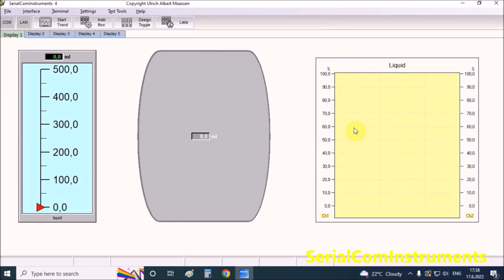Let me also mention that to each individual instrument we can add a value from a different sensor. By connecting more such instruments we can lay out a complete production process for a product. As you can see from the demonstration, the precision of the sensor is really high and the response is linear, which is ideal for this case. We can even increase the accuracy by using two metal strips placed in parallel and laminated with a plastic wrap. Below you can find a brief description of the sensor as well as the whole device.